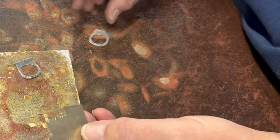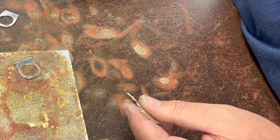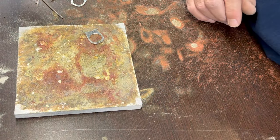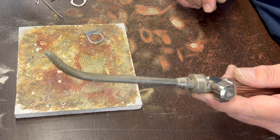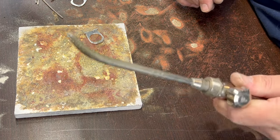So if you've never been to my channel before, I use hard silver sheet solder for pretty much everything. And I use My-T-Flux, which is a liquid flux that I spray on. My torch is a Smith, used to be called a Handy Heat. Now it's called the Smith Silversmith. It's an acetylene air torch. I really like it.